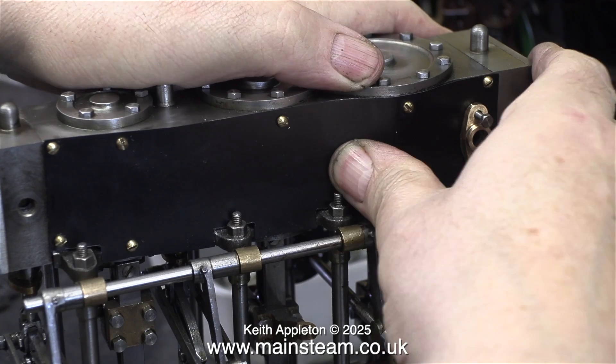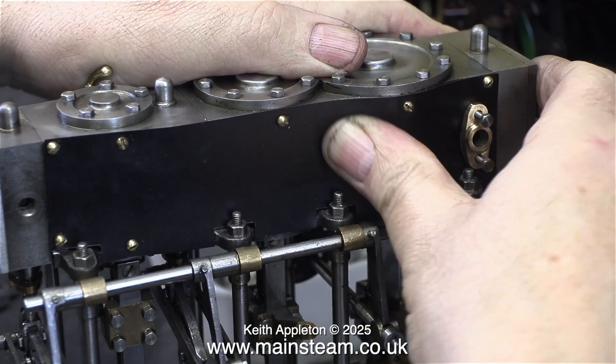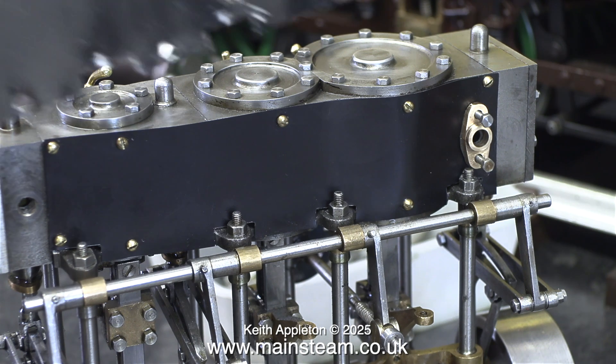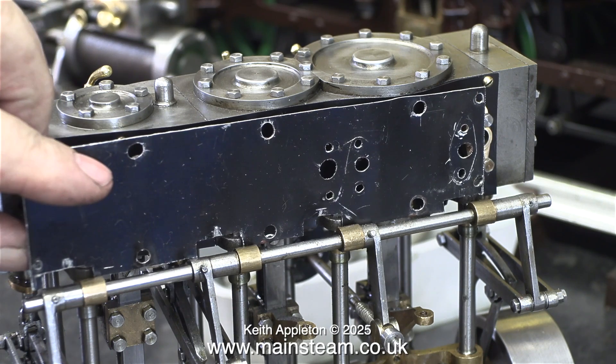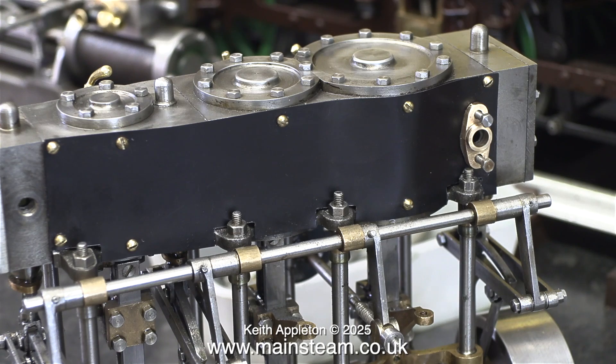Here I'm seeing how much pressure I need to apply to push the cladding into the right position, but this is preliminary — once I've fitted both sides of the cladding I will remove them to apply sealant on the exhaust parts on both sides. Before applying the sealant I'll bend the sides so that when fastened in position they're a closer fit to the casting. In the next episode I'll be fitting the cladding on the other side, which is considerably more difficult due to the number of holes to be drilled. That's it for this episode — stay safe, stay healthy, thanks for watching and I hope you found it useful.